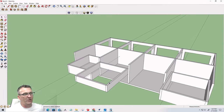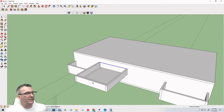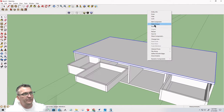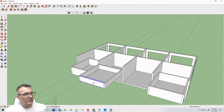Now, on that 3.5 drawer box, I'm still losing 1/4 inch, 7/32, because of the base. So I'm going to be about 3.25 inch deep on these drawers, right? As far as the depth and everything. So if I come back in and I unhide that drawer bottom, I end up with this drawer that's 3.5 inches tall, but the inside is 3.25.